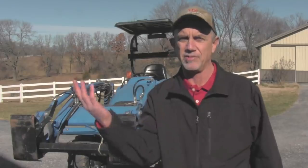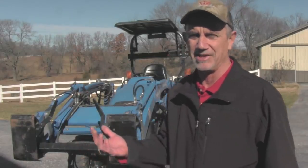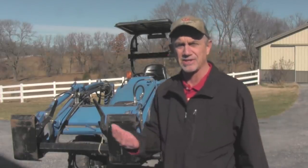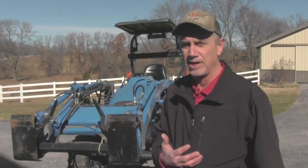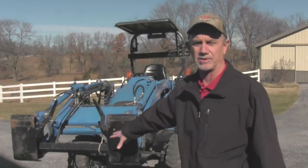With the Deere system there are no moving parts. I hate to say this because I fought Deere my entire career, but they've got a pretty decent system there. There are no moving parts, so it's simple — but it's not compatible with the skid loader system. Why do tractors have the skid loader system and not the simpler Deere system? Because all the skid loaders have it. And on a skid loader, it works great.